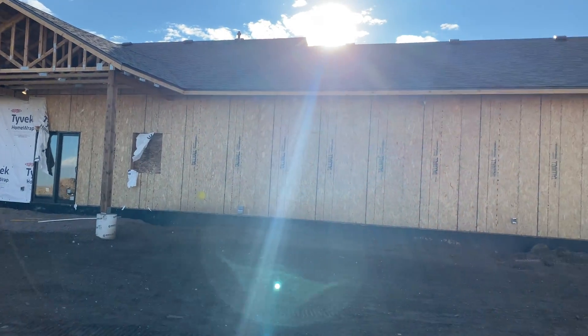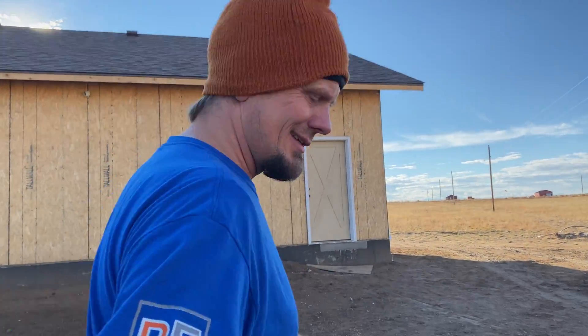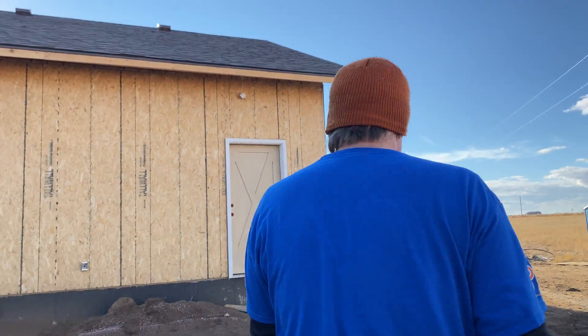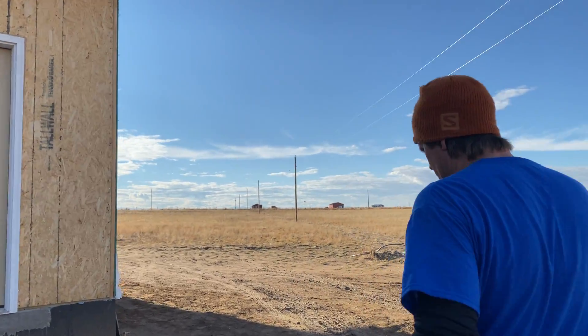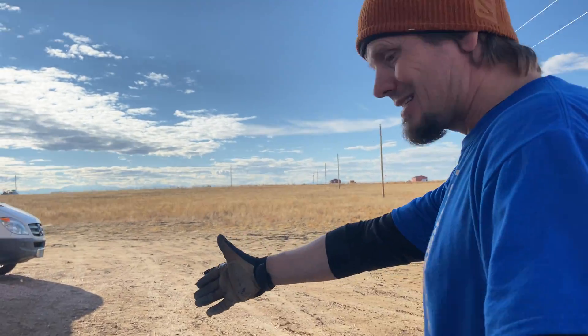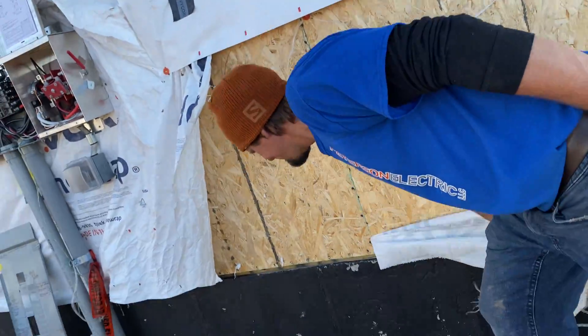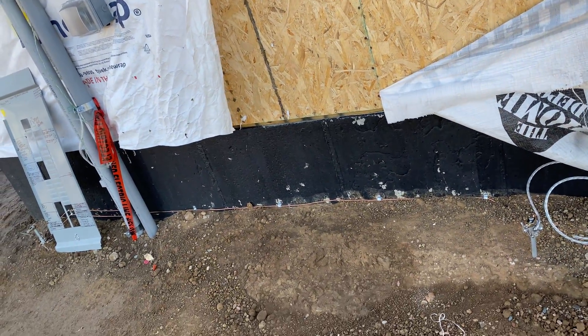I designed my own circuitry on it. They had some generic architect, which was really lame — no offense. But I designed all the wiring myself, made sure I had enough circuit spaces with more available 200-amp service. I still drove two ground rods — you can't see it because the wind took down the tie back. I got a ground here for the generator.